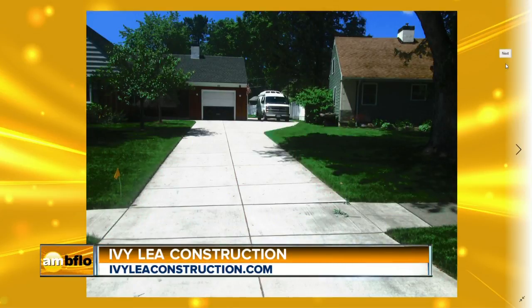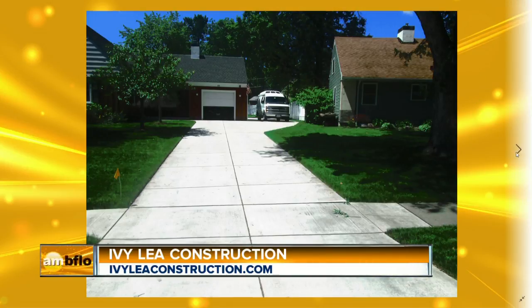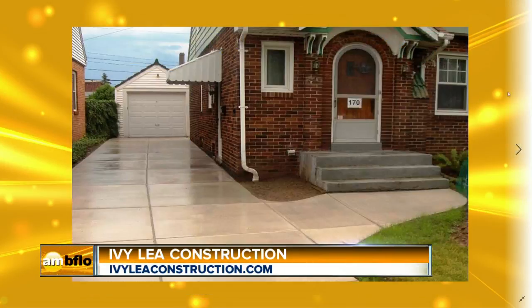And then obviously driveways. We do tons of driveways, full driveways. We can go from the public walk all the way down to the street to do the apron. Usually the apron and the public walk we're going to make 6 inches, and then the rest of the driveway we're going to do 4 or 5, depending on the needs. I love the fact that here you actually made another space for that truck. They had the room, and it opens up their whole driveway. Just take a look at how beautiful this looks.